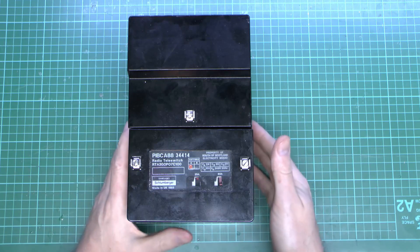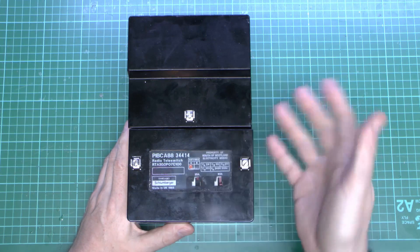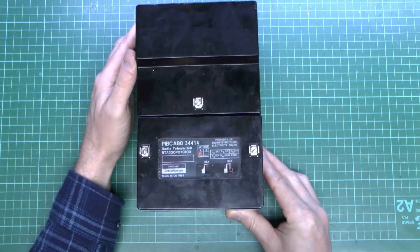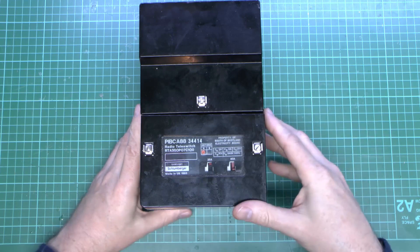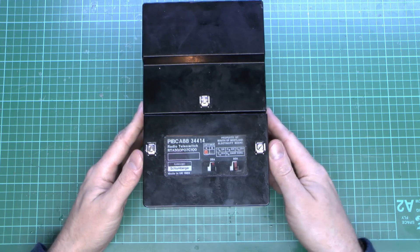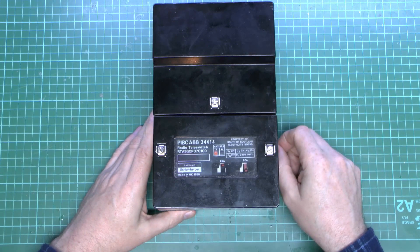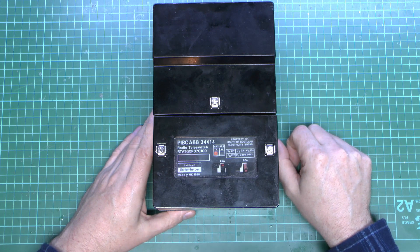It's quite a large piece of equipment, and if you had a matching electricity meter it's a similar size to one of those — a fairly substantial depth, and quite a heavy item as well. This device basically receives the radio signal and has two functions: one is it will send out a signal to your electricity meter so it switches the register to recording on a different rate — typically a night and a day rate — and it also has outputs which actually switch on the electric heating.